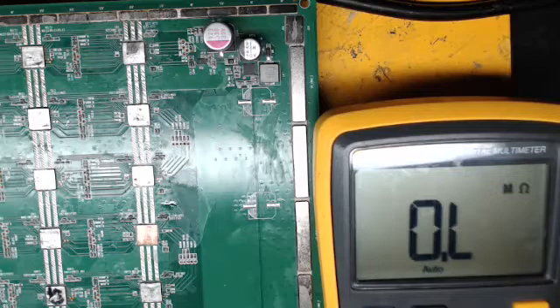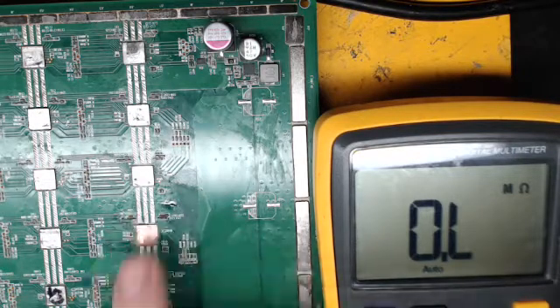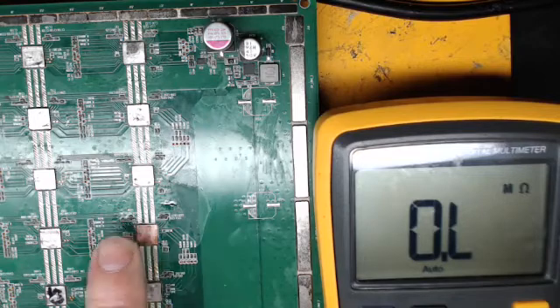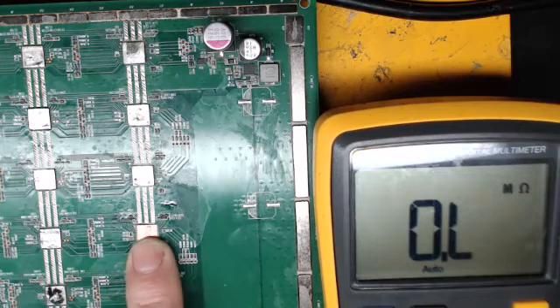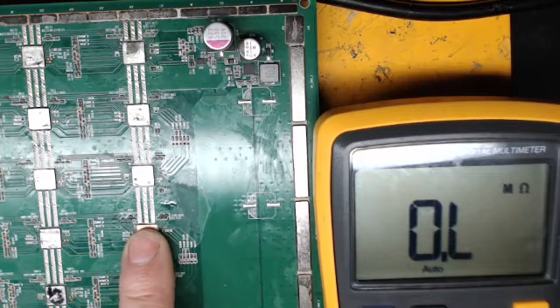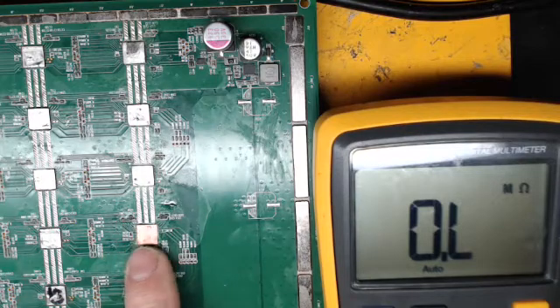I'm really working towards a repeatable pattern. In the earlier video I said I'd go minimal on the solder. I'm going to try to put a link to a video where a guy replaces a QFN chip — he pulls off the old one, cleans it, puts solder on the legs and solder on the pad, just not a lot. I prepared the chip because that's the tool they gave me. So it's a game not to put too much on the pad so it raises the chip so the legs don't touch, but there probably ought to be a little bit on the pad. I actually did see this chip while I was heating it kind of adjust itself — the surface tension on the solder straightened the chip out and lined it up. I still just haven't had the happy place where I can do that every time.